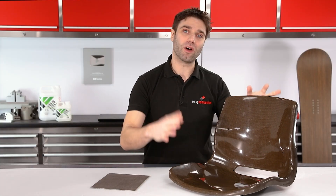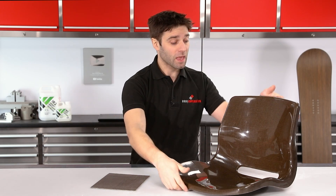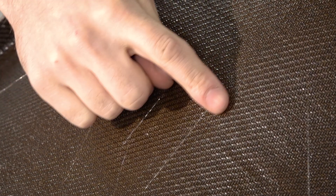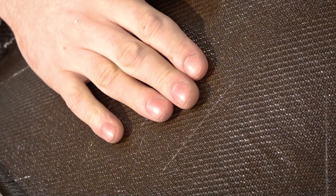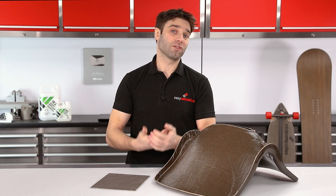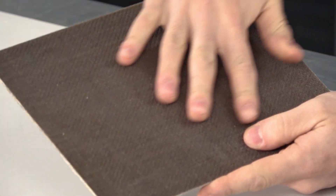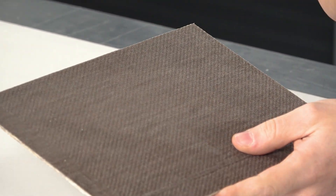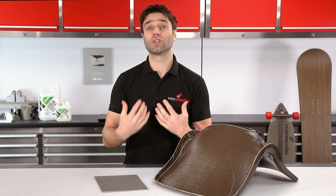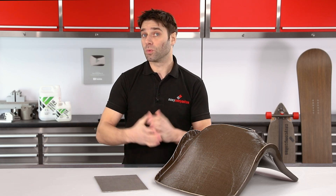Now that we're trimmed up we have our finished moulding. The flax fibre gives a really nice appearance, and the 3.6mm laminate is very strong and stiff — stronger than the typical plastic these chairs would normally be made from. Looking at the reverse of the part we have the finish left directly from the vacuum bag, and if you look closely you can see some lines where creases in the bag have left marks. On a component where both sides are visible it's probably worth considering using a peel ply, which leaves a rough matte texture on the back that's much more consistent and neater. I chose not to use it for this project to reduce consumables, but it's something worth considering.